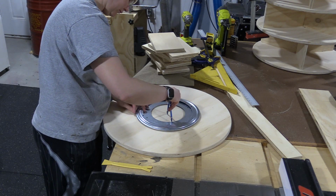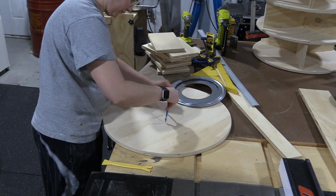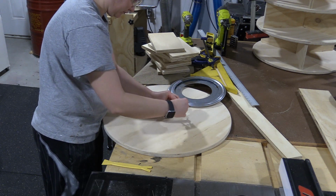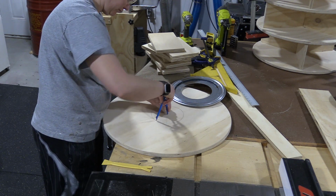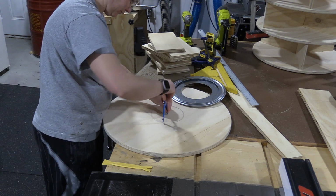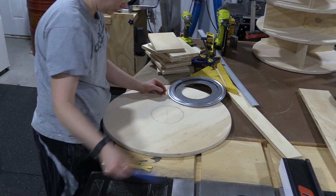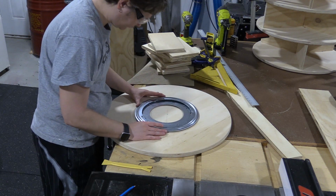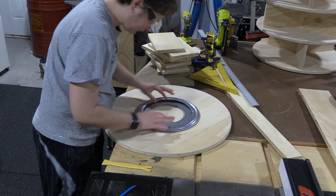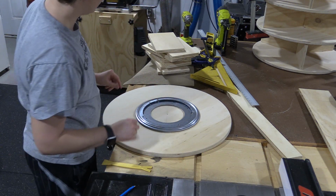I bought a heavy-duty 300-pound capacity Lazy Susan off of Amazon, and I'll include a link in the description here. And it just took me 2 attempts to get this perfect. You want to make sure that this is absolutely perfectly centered on the base so that it doesn't have any wobble. And so the first time I thought I had a pretty good circle, and I thought that I had it pretty well centered, and it was just off a little bit.